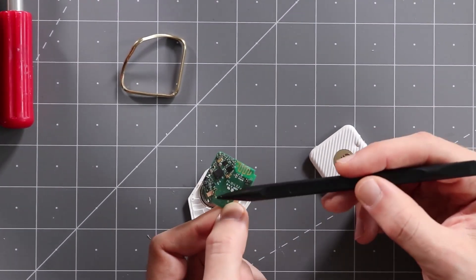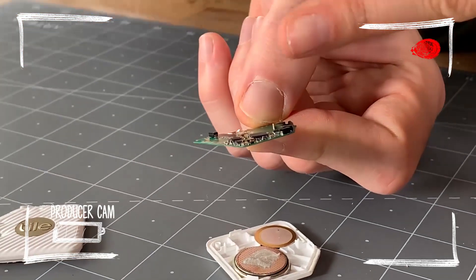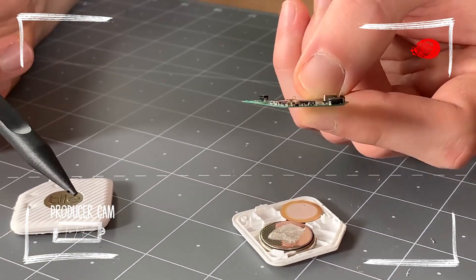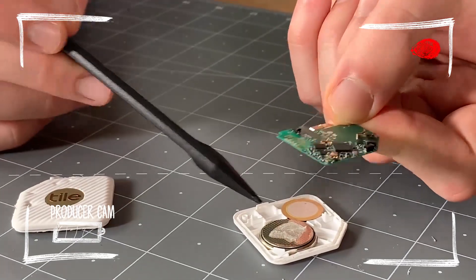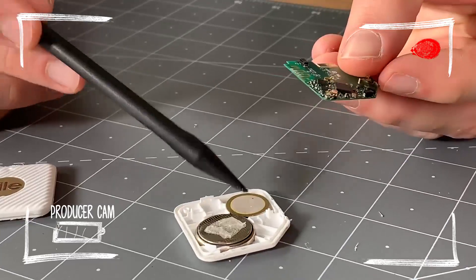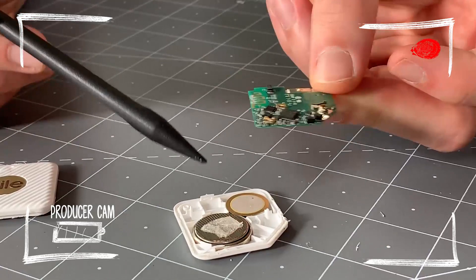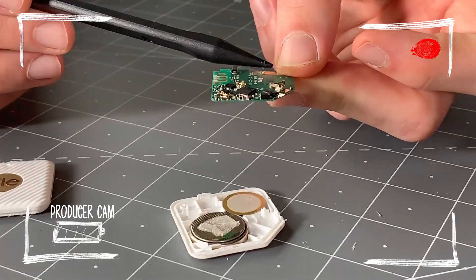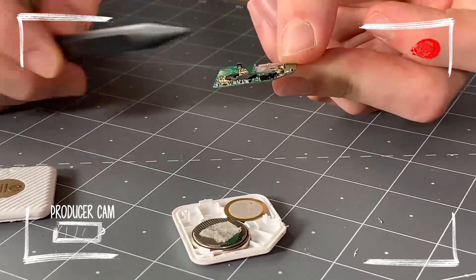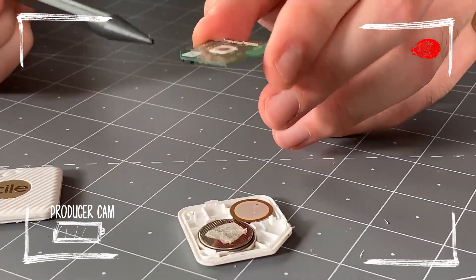This is always the sign of a professional when they decide to reorient the circuit — it's not nulled to the edge of the board, but they've found some optimal way to fit it there. You can see they're dancing around the two metal objects here. Obviously you cannot position the antenna underneath that, so that's off to the side — it's sort of like the West Village street grid. And then the backside has nothing except programming pins and test points.